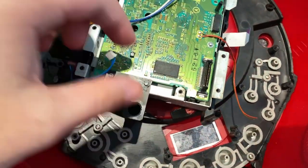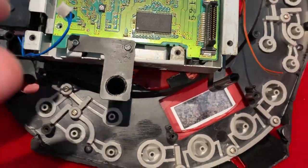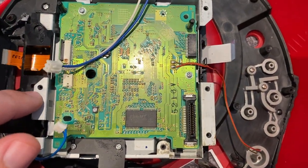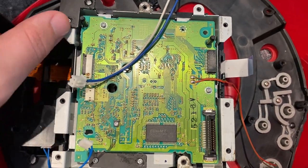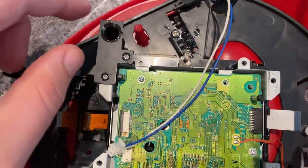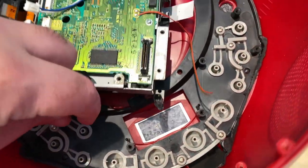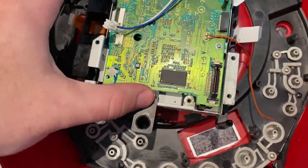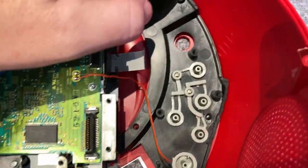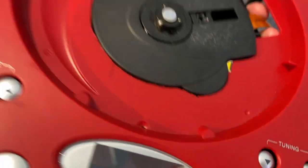This is the solution I came up with for mounting it — two 3D printed brackets. They screw into the existing through-holes on the disk drive, although I think those are just injection molding holes from the factory. There are two screws for each that thread into those holes as I screw them in, and then one larger screw on each that connects to a previously used, now unused hole on the inner housing. That squishes the brackets down into the housing so it stays as one piece. Once the black inner housing is screwed onto the red outer housing, it'll all be secured in place. It actually fits and looks really good — I'm really happy with how it turned out.